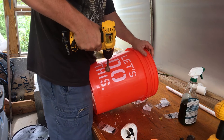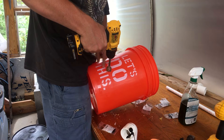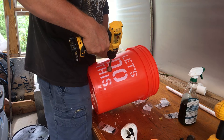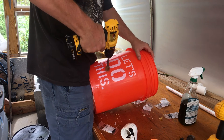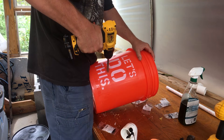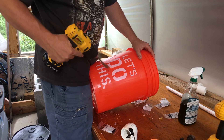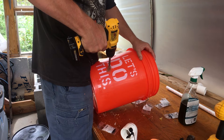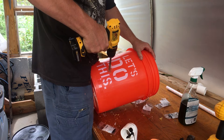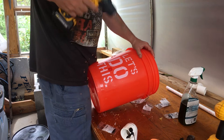When you're using these spade bits, don't force it — let the bit cut the circle slowly or it'll grab and tear chunks out of the plastic. You can see how it's cutting nice and clean right there. Just let it cut, then clean it up a little bit.